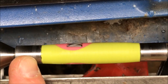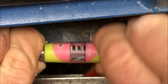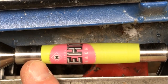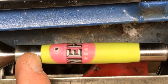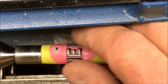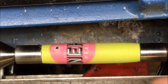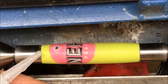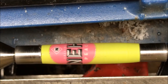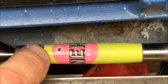I've got a little bit of a divot there — let's turn it down and see what happens. I'm just trying to keep it moving so I don't glue my bushings together or my bushing to my blank. Starting to kind of seize to my bushing — let me get it off the lathe and clean up the end and clean the CA off the bushing. You can put wax on these bushings and it won't stick; I just don't happen to have any handy at the moment. Let me just drop a little bit of CA on there.